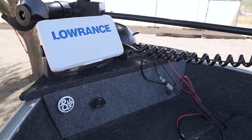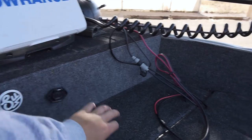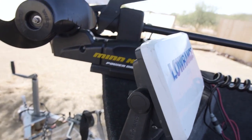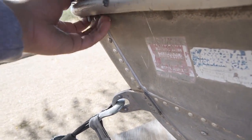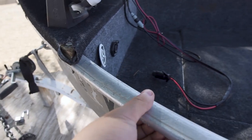I'll show you how I made this nose piece and how I fabricated it. I'll show you the receptacle and how I mounted it on there. I actually have a quick release bracket for the trolling motor, which allows me to slide the trolling motor on and off when I need to. As you can see, I have the nose closed off and a receptacle that I can plug — that guy just plugs right in there. The fish finder is mounted onto the U-bracket here with four bolts through it, and the nose piece is fastened down through the gunwales with a bolt through that lip.